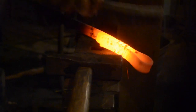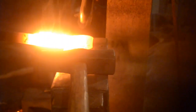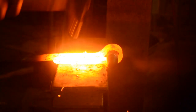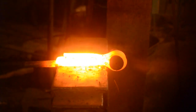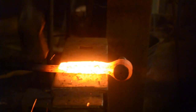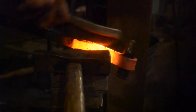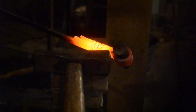Once you've lost your welding heat you want to go over it with the brush again, clean out as much gunk as you can, then add more borax and put it back in the fire. You want to get it back to a welding temperature again. At this point the pieces are tacked together but they're not properly fused. I'm inserting the mandrel again and I'm closing up the head just below the eye. The cross peen is good for working in tight corners like this, and you can use the corner of the anvil to get the other side. I ruptured my weld a little bit here and the outer edge lifted up, but not to be dismayed — it can be easily fixed. Then I brush it off again and add more borax. At this stage I could also peel off the wire wrap, but as this is just a rough and dirty axe I'm not going to bother.